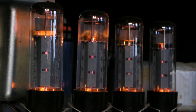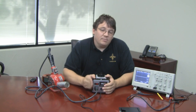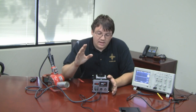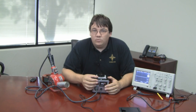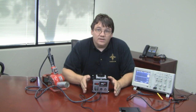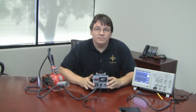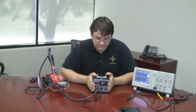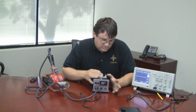Even for modern tube amplifiers, many musicians have a specific voltage at which they like the sound that comes out of their amplifier. The problem is when they take their amplifiers to different venues, the wall voltage can vary — you can get 110 volts, 125 volts, a whole range. With a tube amp, to get that same sound every single time, you've got to have a constant voltage. So you take your Temco Variac, plug your amplifier into it, and set the voltage as you want. If your amplifier runs best at 118 volts, you set the output to exactly 118 volts and you get the sound out of your amp.